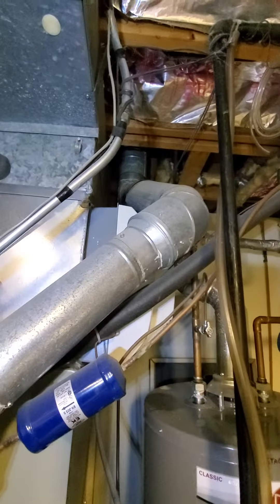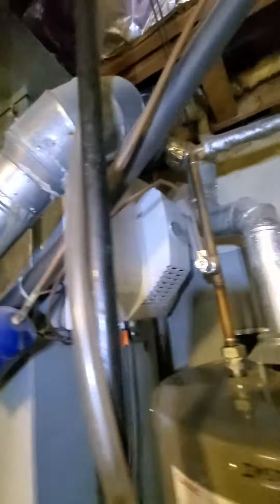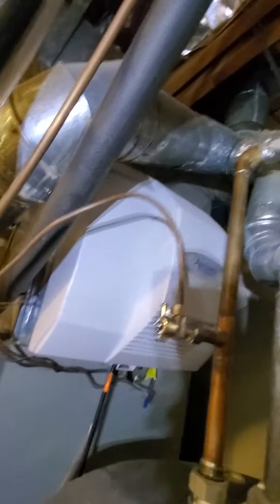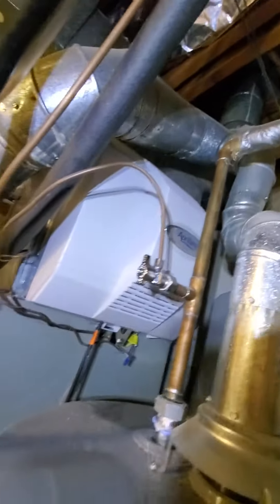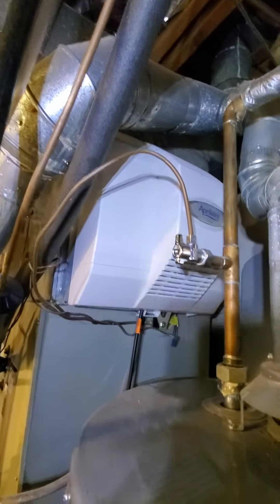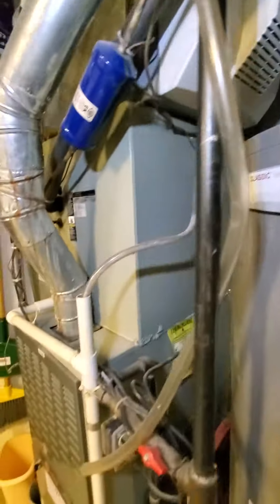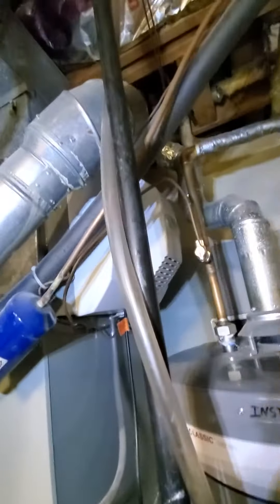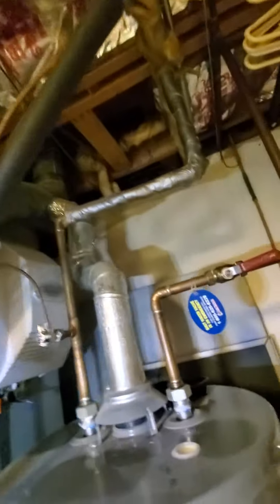Just realized your humidifier is here. So maybe an inch, because that humidifier will come very close to the flue exhaust. So just keep that in mind and also check out the humidifier to see how it is inside — it is rather old, though the casing is new. Your supply trunks are coming in at about 14x8. There are two of them, 14x8, and then it tapers down and another 14x8 back there.